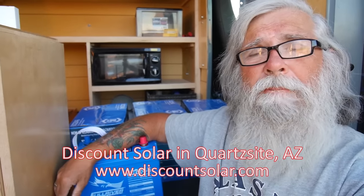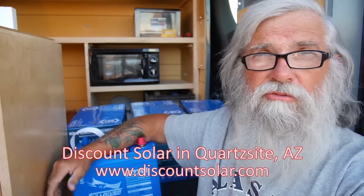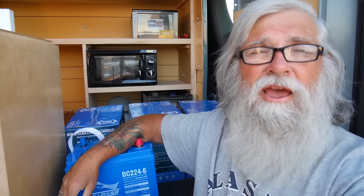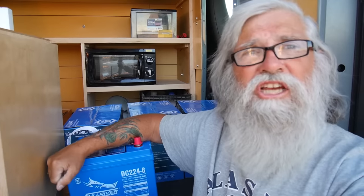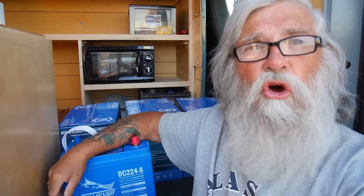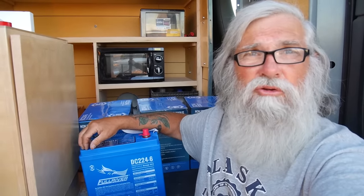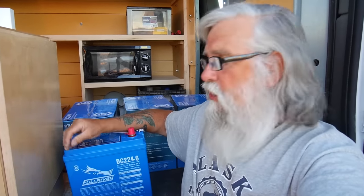So it came to a little over $1,000 — $1,036. A lot of money, but these should last me. I also upgraded my solar from 380 to 480 watts, which should keep them fuller. I'm thinking about upgrading my controller as well. AGMs like to be charged pretty hot and fast, which is an advantage — they'll take all the power you can give them. They like absorption at about 14.6 volts and then float at about 13.8 volts. During absorption, you can set them really high and they'll go to 100% full really fast.